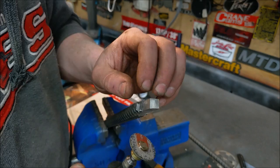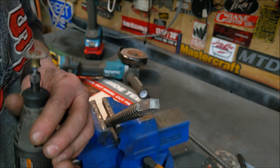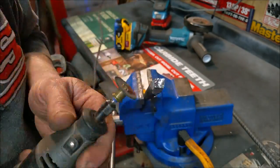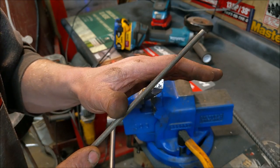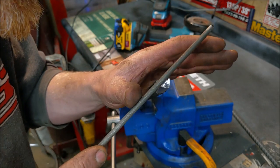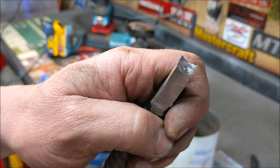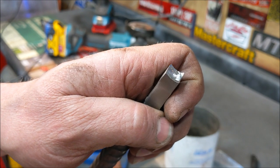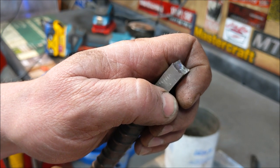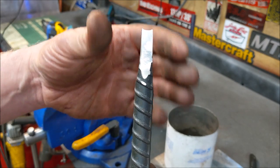It's going to look like a four-pronged king's crown — dished every direction with those four little points as the crown. I'm using a round chainsaw file. Not perfect, but that's what you want: sharp edges and a dish. You could drill in there first, but you'll probably get a little off-center — I think the grinder works a little better. Use a combination of tools and try to make your walls as straight as possible.